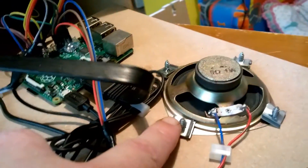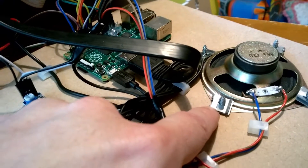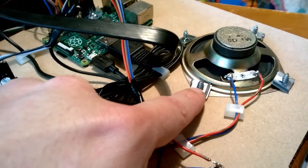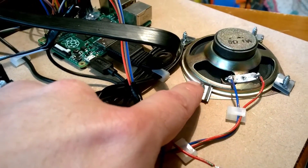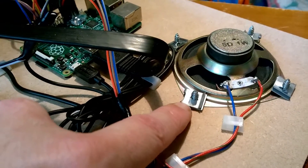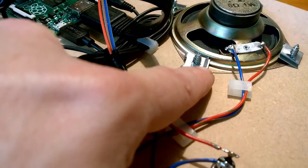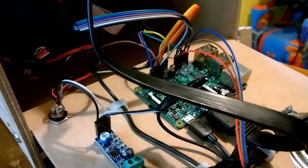For the speaker, I'm using what's known as speed clips, commonly found in car stereo shops and also on eBay. I use stainless self-tapping screws — I like stainless, no rust. The speed clips create a screw thread where one doesn't exist, and they clip onto the speaker as well. Very simple, very cheap — I do recommend those.